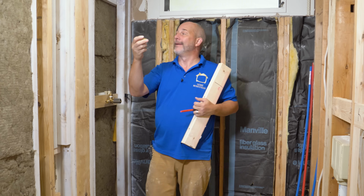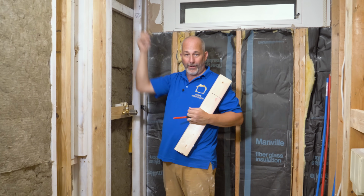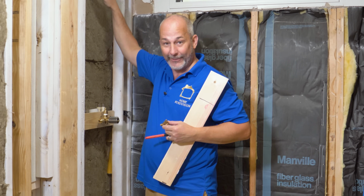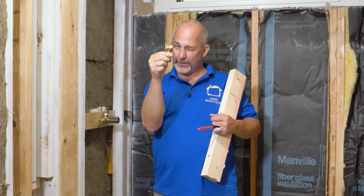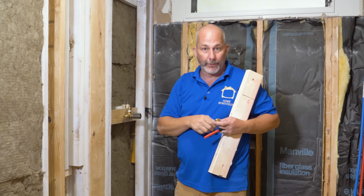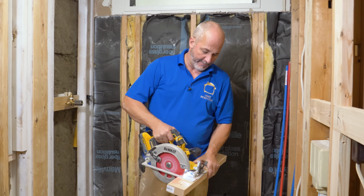So if you put this too deep in the wall, the shower arm that comes with it only has about a 5-inch stub. And so you don't want to lose 3 inches of that in the wall. All right. So you want to get this right close to the surface of your wallboard installation, whether it's drywall or cement board or Ditra or Kerdi board, whatever you're using.